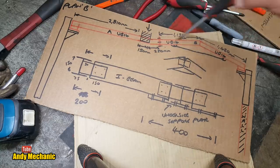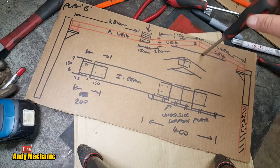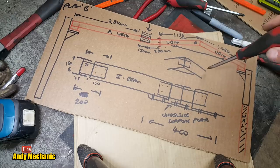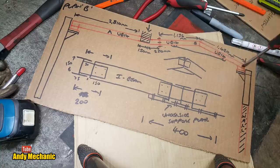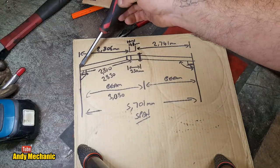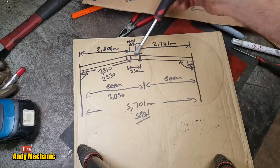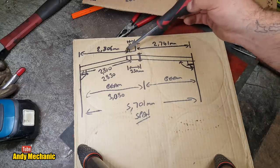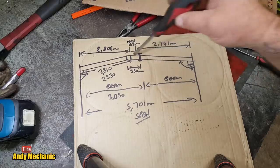However, it's not really a very good shape for a beam. The original plan was to maintain as much head height within the workshop as possible — because we've got the motorcycle hoist, I want to bring cars in and use the engine hoist, lift engines out if need be. But ultimately this beam has to hold the roof up, and that apex shape isn't a very good engineering shape. So on the new design, we've got the angle of the roof on the lean-to, then a straight horizontal section of 350mm in the middle, which replaces the timber beam that runs 90 degrees — that gets replaced with I-beam sections mounted between each of these transverse beams.